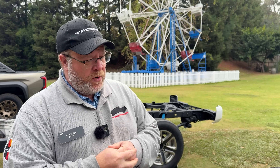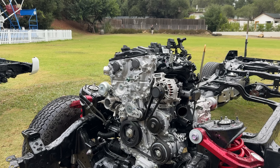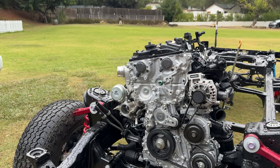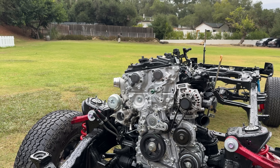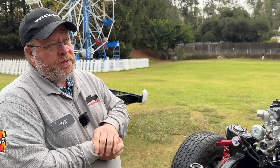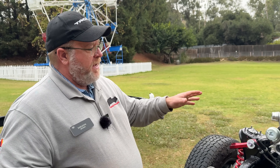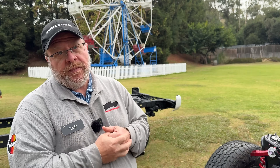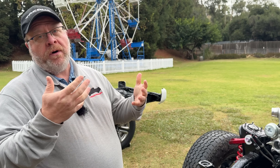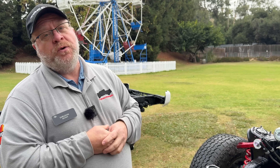Specifically on the heat — we don't have the full cool pack here — but what's important is on the water inlet: we're using a pump and water inlet that would normally be specced for our V8 motor, about three inches in diameter. That's to make sure we have the flow, pushing water through the engine cooling jacket to keep temperatures in check and ensure the longevity of these motors. Recognizing that duty cycles are different and that we're going to be doing things like towing, we run all these motors to what we consider our commercial grade, especially componentry such as the turbo, to test them under even more extreme circumstances and larger duty cycles to ensure we're providing a powertrain suitable for truck customers.